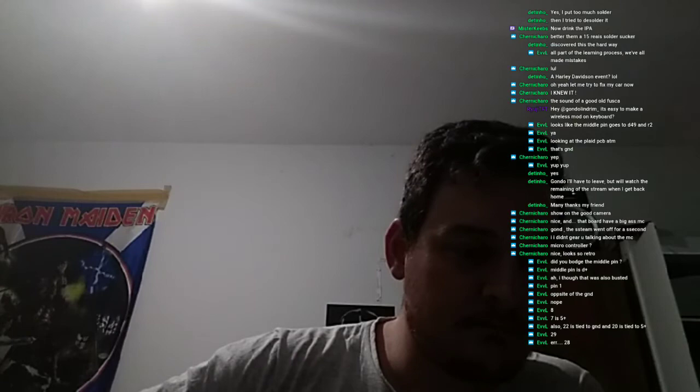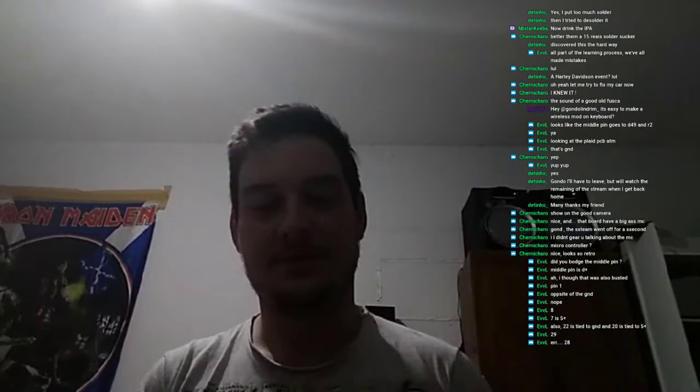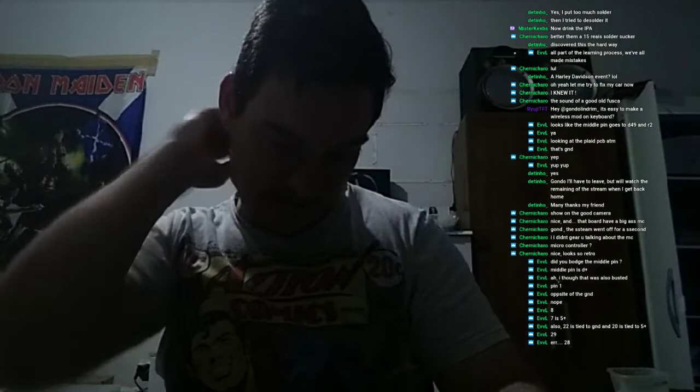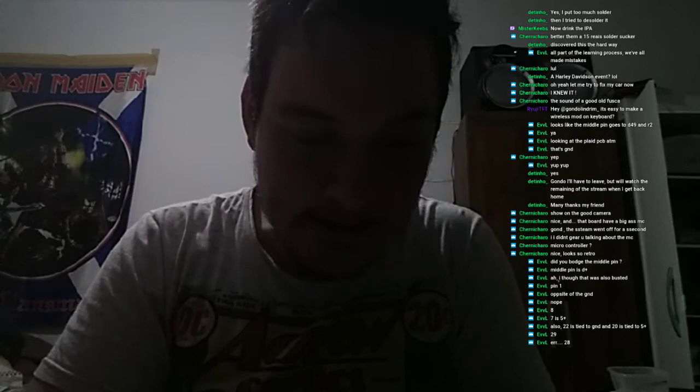By the way, this boot switch here, I don't own a Plaid, so I wouldn't know, but there is a boot switch here that's not soldered. Let me show you. See, you have the reset switch, which is here, and you have a boot switch. Is this boot switch supposed to be soldered so the PCB can work? Because I'm afraid that microcontroller is here.